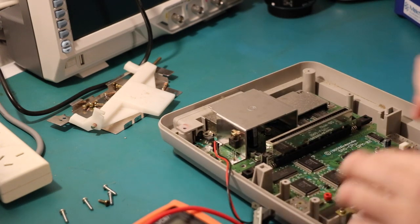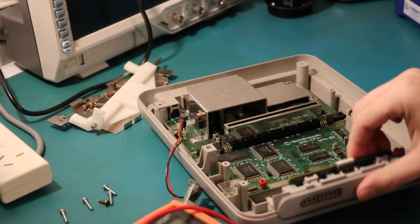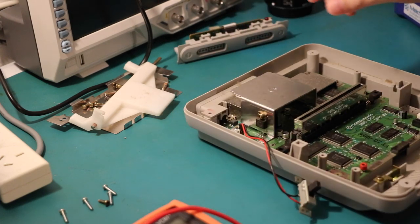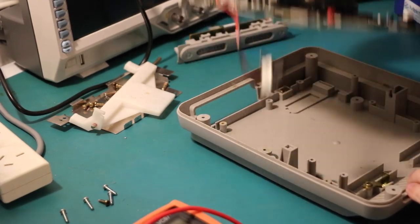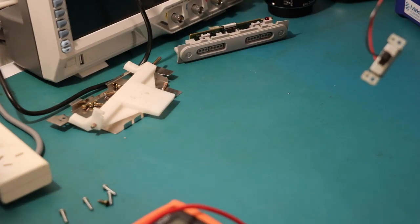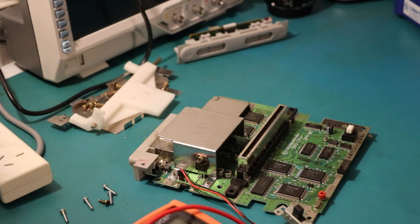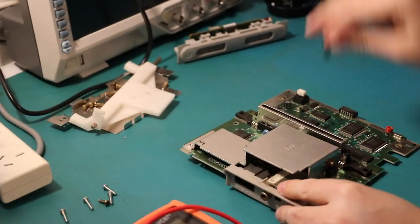Okay, so, front bit, you'll want to disconnect that ribbon cable. Once that's nice and disconnected, you can set it free. And then lift this little guy out. There we go. Give your base a bit of a dust out as well, while you've got it in pieces. Also disconnect the power there.